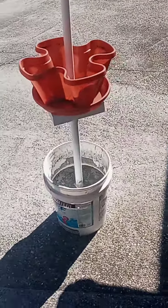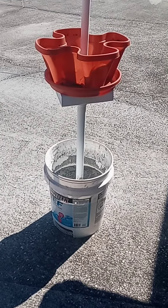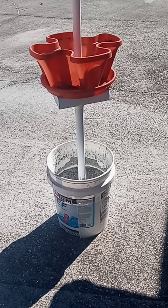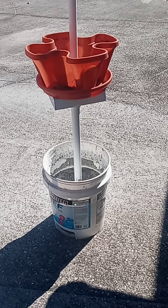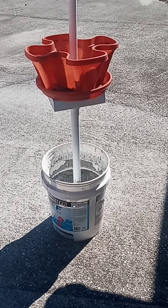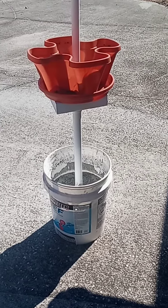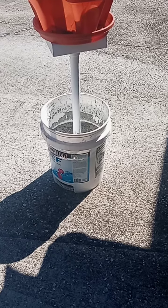The bottom section of the pipe and the wood block have all been painted in exterior-grade latex paint, because UV rays degrade PVC and will make it brittle and crumbly and it'll fall apart. So we don't want that to happen, so we're going to coat everything with a good exterior latex. The bucket will be cleaned up and painted with that exterior latex as well, because I don't want that bucket falling apart.